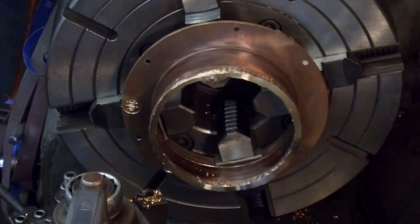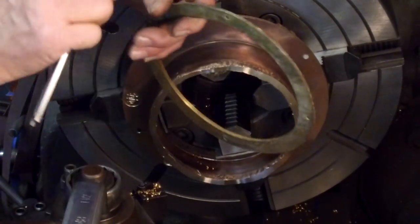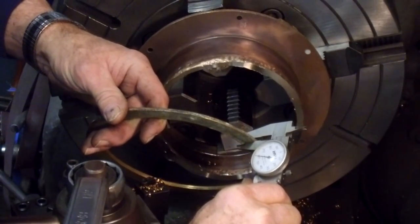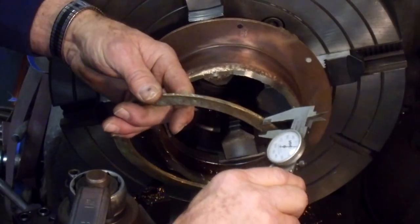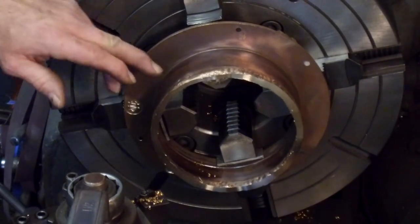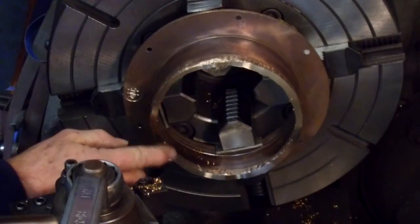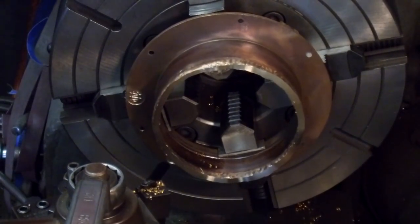All right, now we actually bankrolled ourselves a little bit into our planning because the customer told us twice the thickness of this, and I just roughed it out at 200, and it's really 160, which would be 320, and we shot for 400. So we left ourselves at least 80 thousandths to play with, just a little bit over a 16th of an inch. Looks like we're pretty darn close, and that's why we were looking at what we needed to have up there to have a plus.